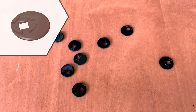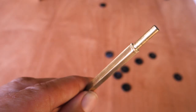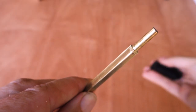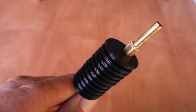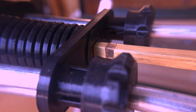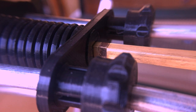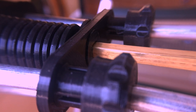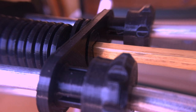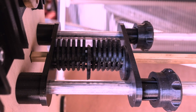At the very heart of the design are these discs with square holes in them. The discs are stacked on this square shaft, which locks them into position. I guess it's more of a spine than a heart. One section of the shaft can be rotated 180 degrees, and the whole shaft slides back and forth, positioning the driver inside each of the discs in turn. That way you can put any pattern on your spine.